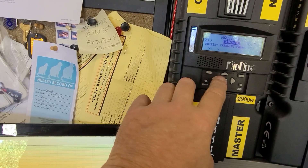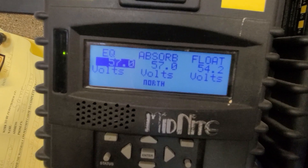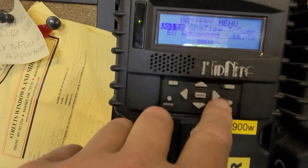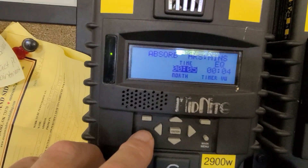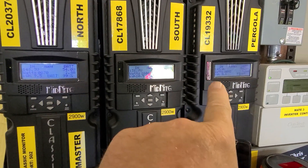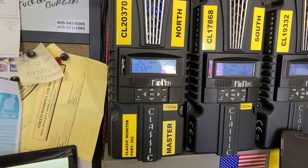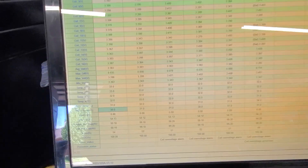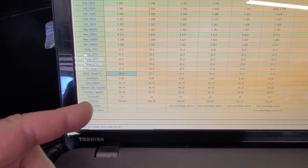Let me show you how I have these set up. The parameters I've got in: absorb set to 57V for five minutes. To set the time, go to 'charge time' — five minutes, bada bing. You have to do all three inverters even in follow-me mode. All three have green lights and are in float, so everything is good. If you're thinking that's too high, it's actually well within specs for these EG4 LiFePower4 batteries — absorb at 57V is about a volt and a half below max.